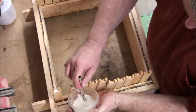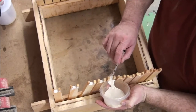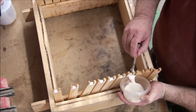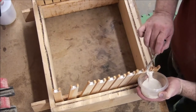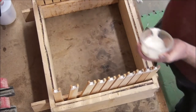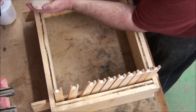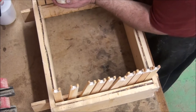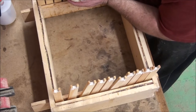By the way, start with the bottoms — start putting the bottoms on first. If you start with the tops you have to flip your jig at the end. The rule is: enough glue and not too much glue. A little drip at the end is good — you know your joints are full. Glue running absolutely everywhere is a total waste of money.